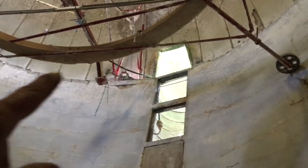So it was up to, now you've got to have 2 doors left out for the unloader to go around. So we're going to have to move that door and that door. We'll move them up, and then that's where we'll set the blower pipe, which is still sitting on the unloader. We've got the unloader pulled up to the top of the silo from when we filled it. We took the blower pipe off that we've got to set on there.